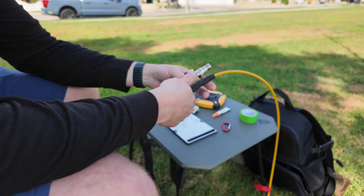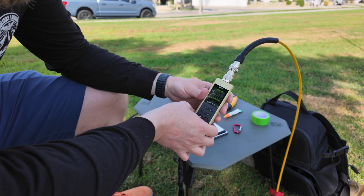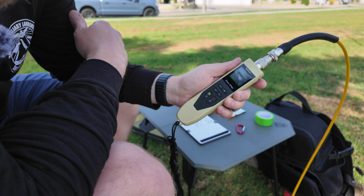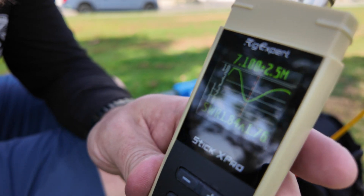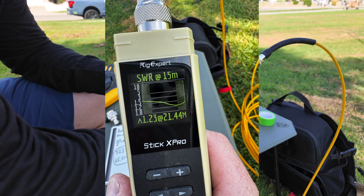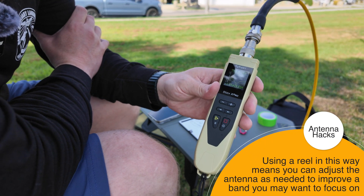While it's a really quiet day at the park, I'm not trying to risk it at all. I don't expect to have nailed the tuning on the NFED right off the bat. So we've got to check it. I'm using a Stick Pro. 40 meters — looks like we're not far off. It is a little long, so we're going to shorten it a touch. That's about perfect for what we're going to be doing, which is whisper testing. Although it's a little long on 20, so let's go up the line a little bit. A little short on 15, and it's quite pretty on 10 meters at a 1.04-to-1 SWR. We're going to run with this — it's kind of a sweet spot between the bands of operation.